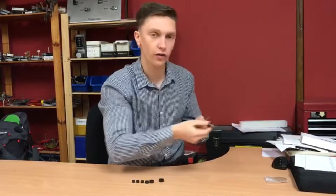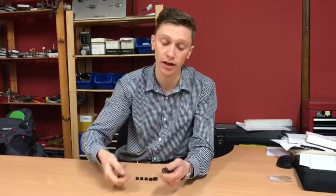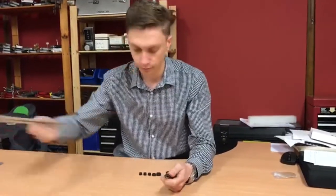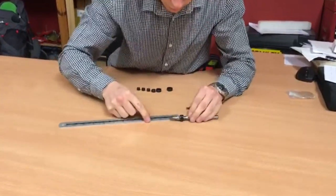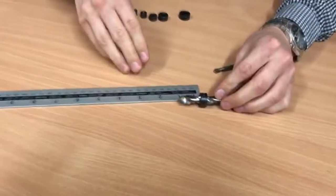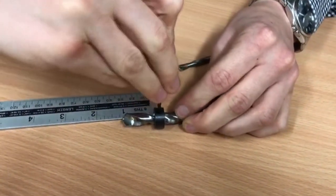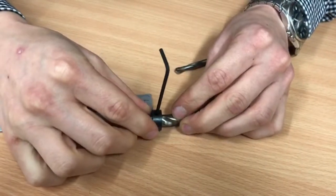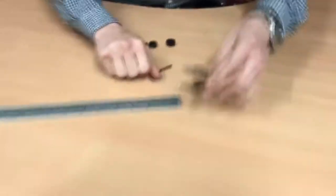Once it's tight against the door, we take it off and we need to add the millimetres for the casing. We want to drill into the lock but not hit the levers. For a non-British standard lock, you only add one millimetre. For British standard, you need one millimetre for the case and then two millimetres for the standard plate. So I'm measuring three millimetres back and moving it about three millimetres, then re-tightening it.